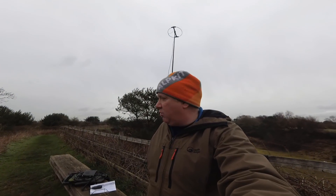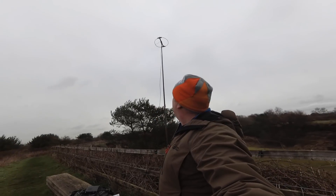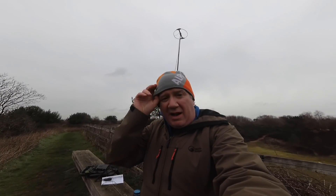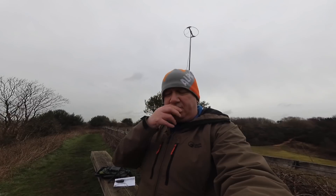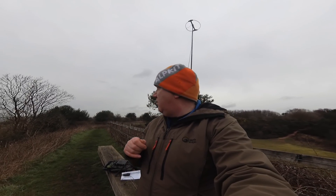I also need to look at using stacked halos to give more dB gain. The weight of this particular one is about the same as a small mobile phone — really lightweight. It does strap onto the backpack quite easily. One of the weakest areas on this version was the gamma match, especially where it fastens onto the capacitor — all of that needs to be better protected so the strain doesn't pull on it, but still easily accessible so we can adjust the variable cap. There's more work to do. Hopefully I'll get more of that on video over the next few weeks and we'll see the next version of the antenna put together as well.